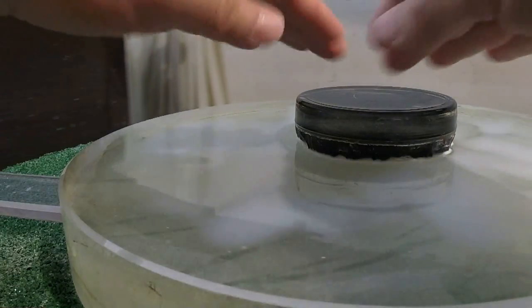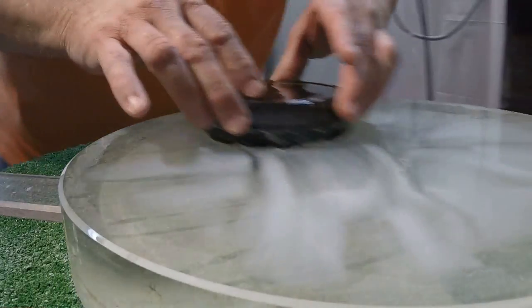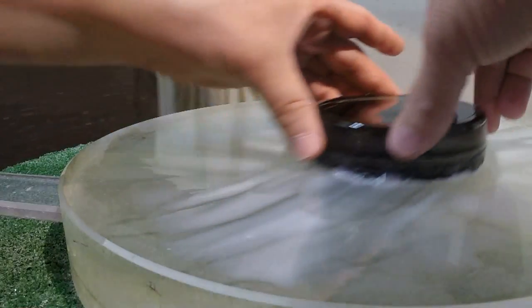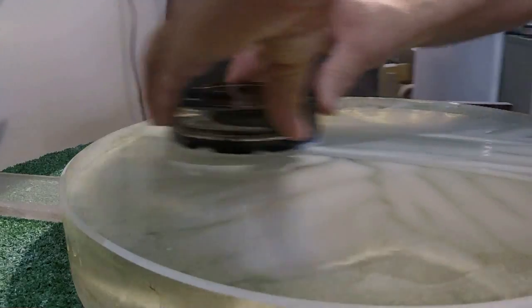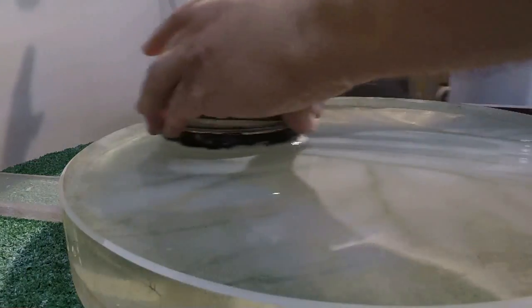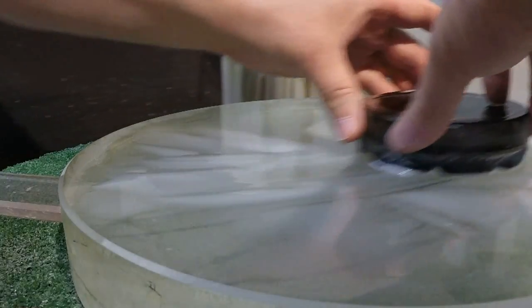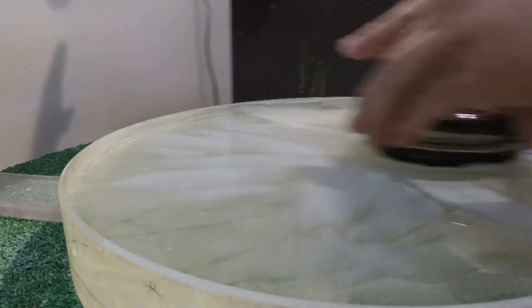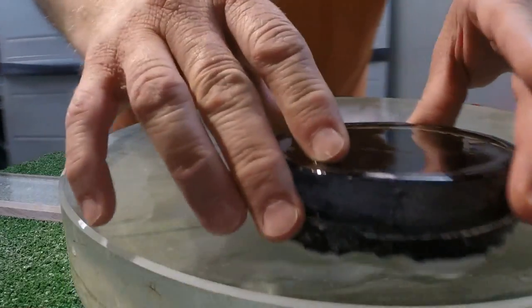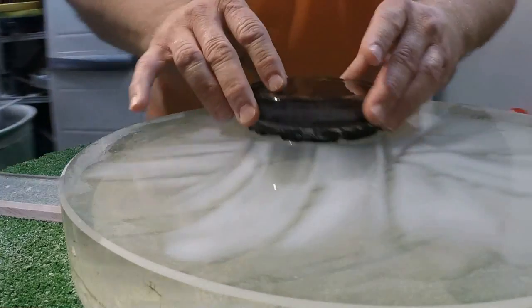The mirror was a little extra high in the very center, so I also used a long straight stroke, going back and forth, but offset about a half an inch or three-quarters of an inch to the right of center. The reason for that is most of the action takes place underneath the polisher on the edges of it. If you go right up the center with this four-and-a-quarter-inch tool, you'll wear a groove — a track — in the mirror two inches either side of center, ending up with a bad zone. By offsetting to the right, the right side of the polisher hits the mirror at a different radius than the left side, spreading the work around and avoiding a zone in the center.